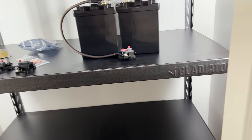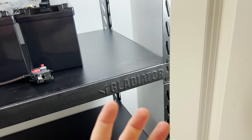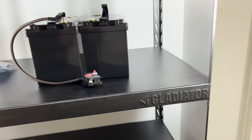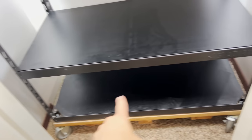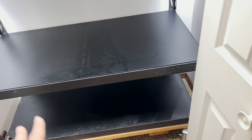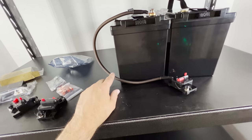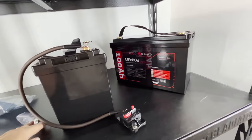Today I tapped a distribution bus bar that's going to be replacing the bus bars down there. I haven't messed with those yet because I still haven't finished the base plate. The more I look at this, I was really trying to avoid buying two 45-inch really thick copper bus bars to go across. My idea was I can have a positive on one side and a negative on the other, and then do the same thing on that shelf. Every set of batteries is going to be 24 volts. This is a brand new set I just got — it's from a company called Dr. Prepare. I've got to do some testing on this and do a little review.